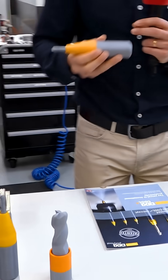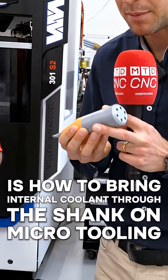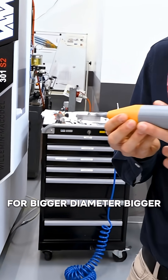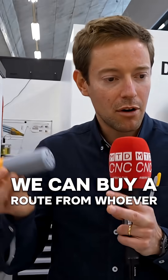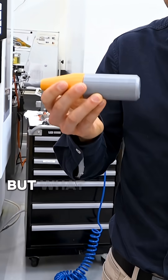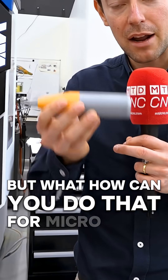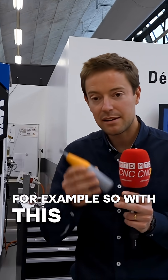The idea is how to bring internal coolant through the shank on micro tooling. For bigger diameter end mills there is no problem — we can buy a rod from a supplier that has a main internal coolant hole and then small holes going into the flutes. But how can you do that for micro tools with a diameter lower than 3mm?